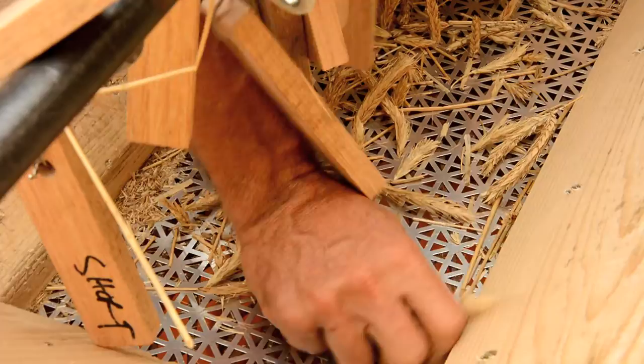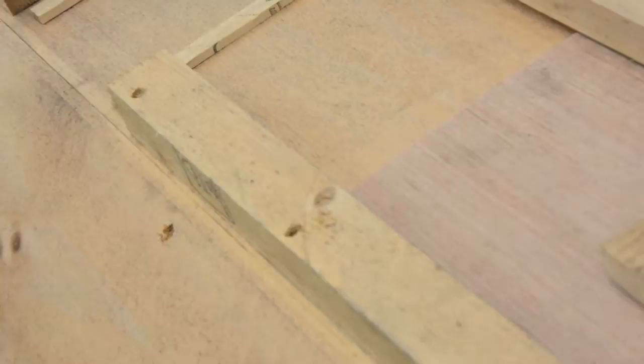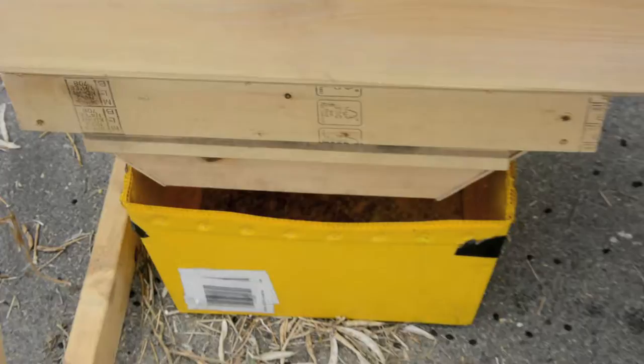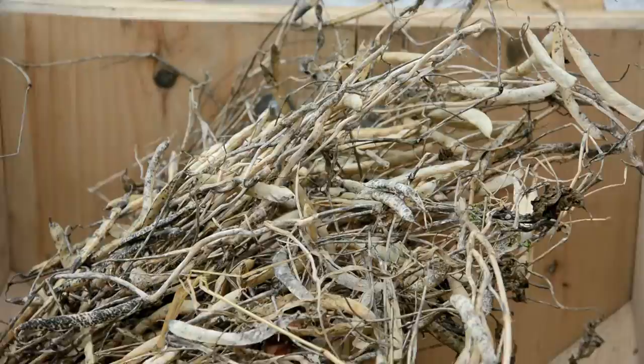Somebody who builds this machine is going to figure out what the absolute best scalping screen is for rye and then tell the rest of us. You want the whole interior volume of the thresher occupied by flails, but for maintenance and construction purposes you need to be able to get the shaft out. Removing the shaft requires a little section of the interior which doesn't have flails on it, because you've got to be able to slide it. To compensate for that, a slant causes stuff to fall back down into the thresher.